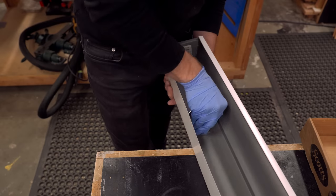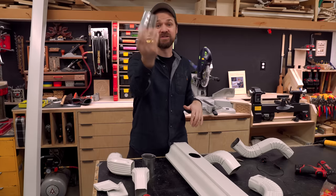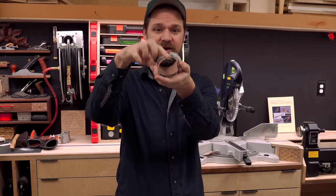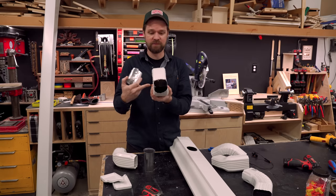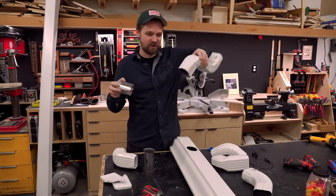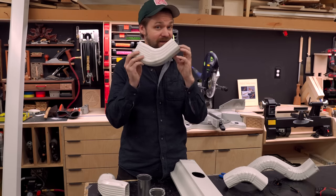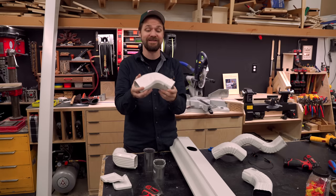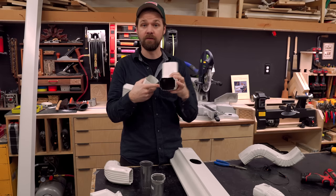After that is when everything went wrong. Last night I shut off the cameras and everything fell apart. I tried to secure the drop out of the gutter and the silicone started to separate. Then the little clipped area also came apart. I got it all back together but then tried to attach the downspout elbow and that started to crumple inward because I was doing it in the wrong orientation — it torqued and wasn't square to the gutter anymore. So I took the whole thing apart. This is the vinyl coupling that I had decided not to use because the small end was on the wrong side. My buddy Dan on Instagram told me you can use a heat gun and crimp these in like you crimp in the elbows — so that's what I'm going to do.